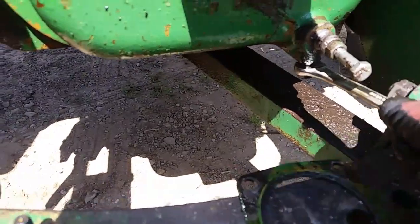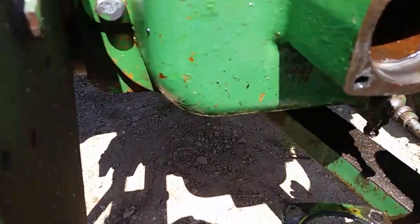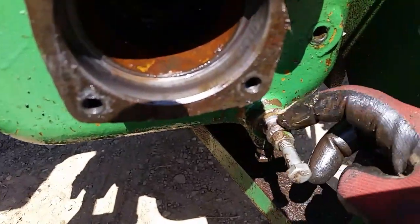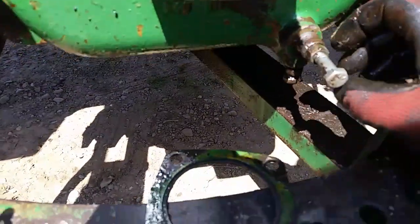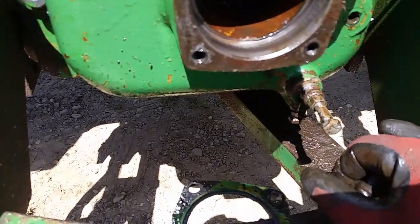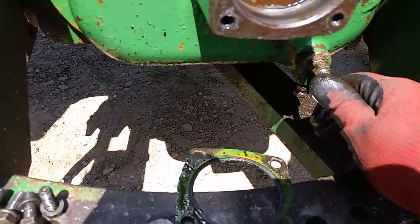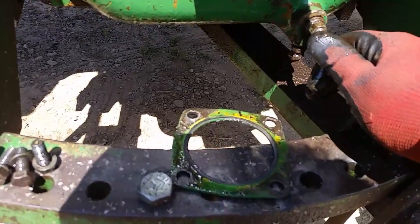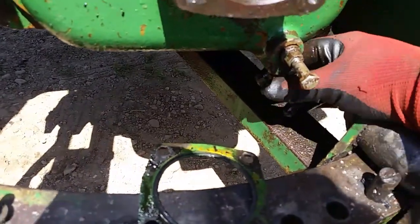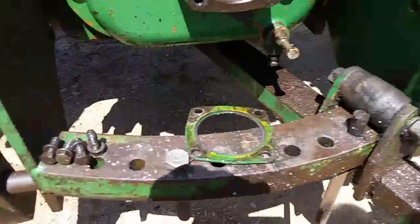To shift, just loosen this jam nut here and then screw the bolt out a ways — it goes into the groove. There's another groove inside there and it'll eventually go in that groove. I like to put a bolt in and just leave it in this rail. The book calls for taking this bolt out and putting it in the end so you can grab it and shift it, but then you don't always hit the mark. When you have it like this, you can turn the bottom bolt and make sure you get the groove. But I can already tell you right now it's not going quite all the way because the gears aren't lined up.